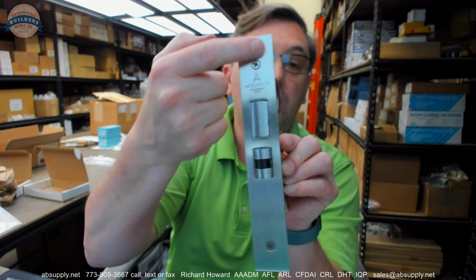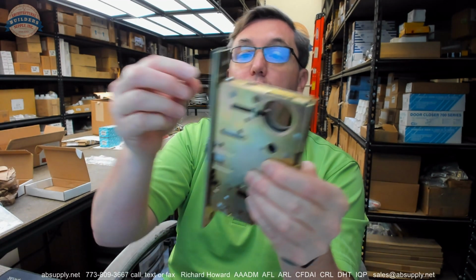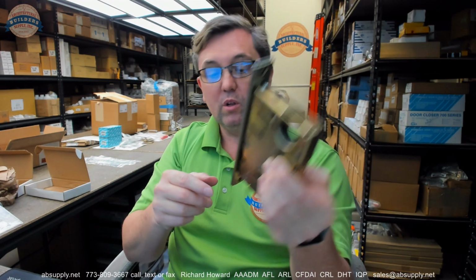Okay, the 2 screws. There'll be 1224 machine wood thread combination. They'll also give us 2 screws for the lock body. Now this part here is called an armor front. When you remove these 2 very small screws, 832 by 3/8 flat undercut head, you'll get to the body itself, which will allow you access to, well, let's just show you.